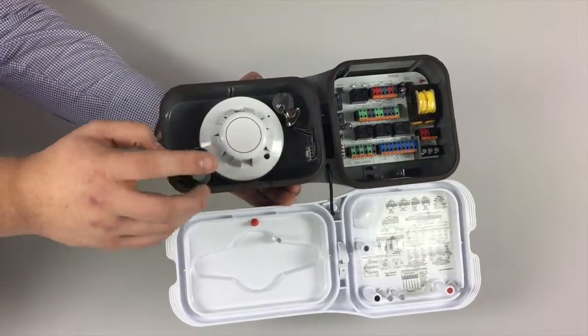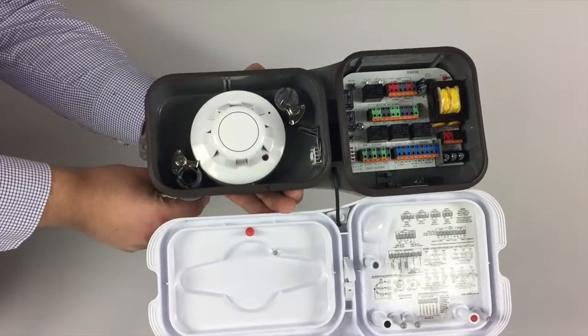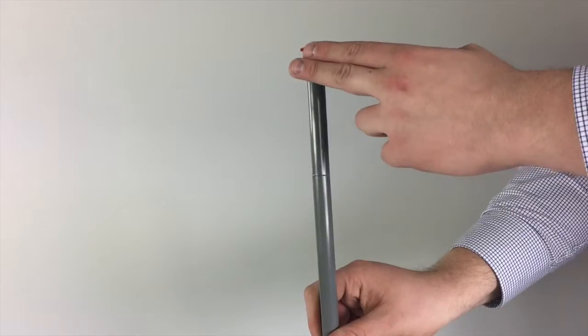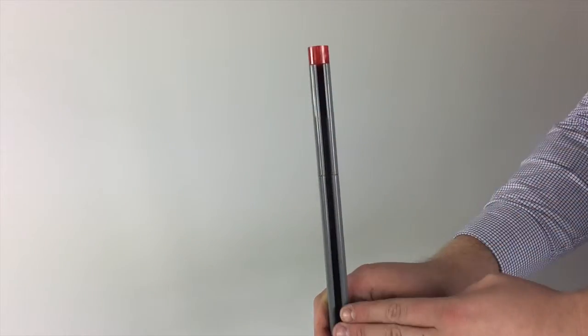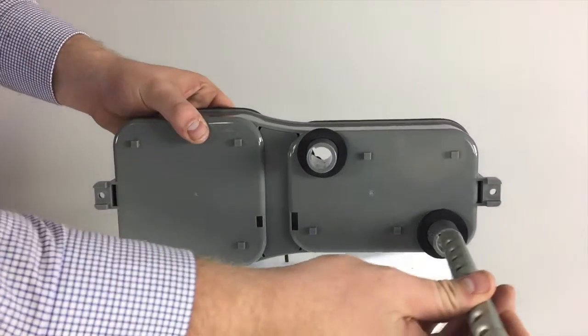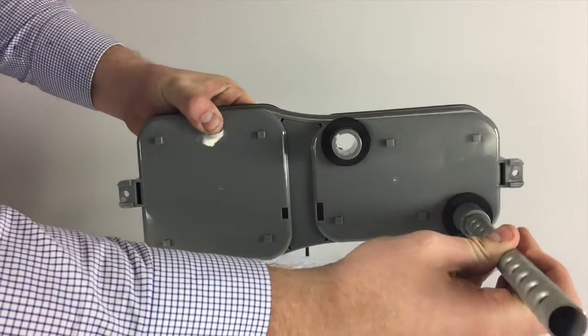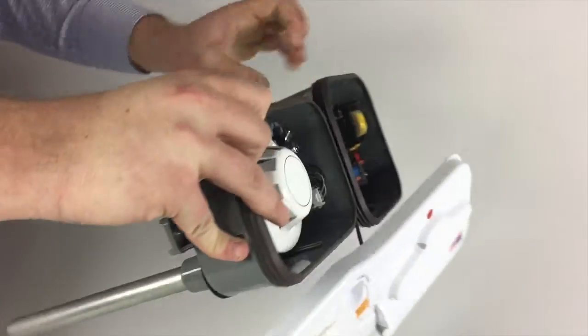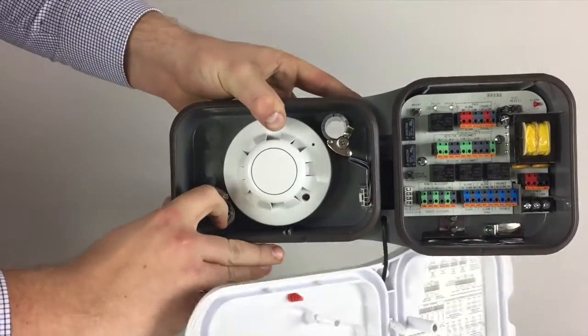Sampling tubes can be front or rear mounted. The tubes have a notch which indicates where the sampling holes — or in this case the fast tube sampling channel — are located. Once the installer determines the position of the airflow, they insert the tube into the duct so the airflow flows into the holes or channel. Once they rotate the spring-loaded retainer, the tube is locked into place.